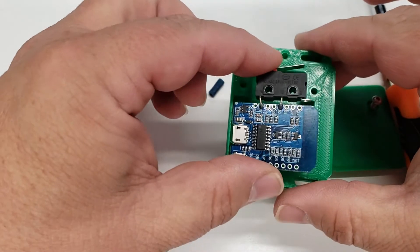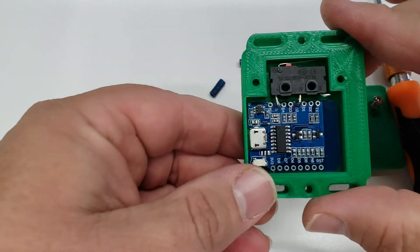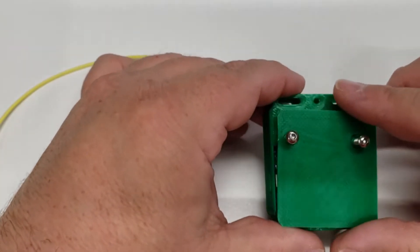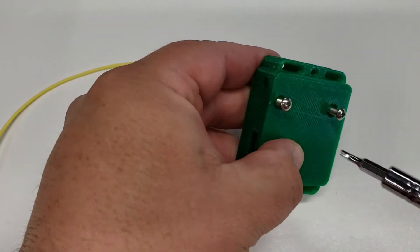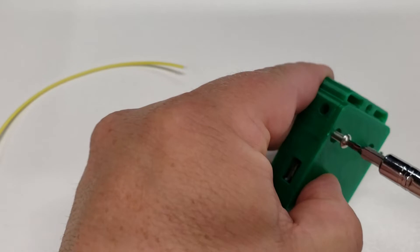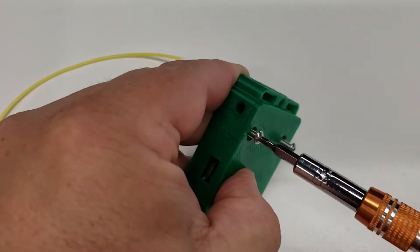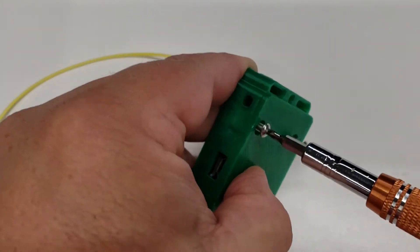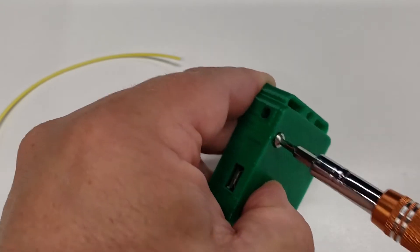Next, we're going to take this board and drop it right into the 3D print, then put the cover on and screw it into place. A quick note: I did not use PTFE tubing. A lot of these designs do include it and you can certainly use it, however I found that the clearance is tight enough and works well enough without it — so one less part for the entire project.